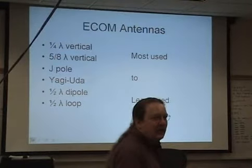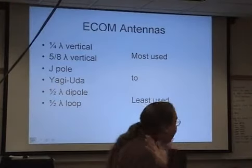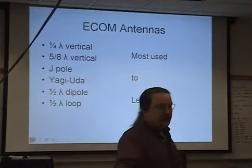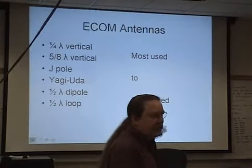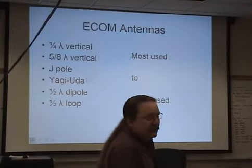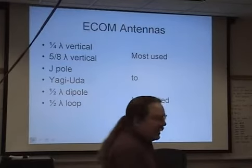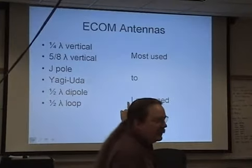If this is really close to, say, a wall, a metal wall especially, or a beam, it will get detuned. It will tend to suck power away from the radiation pattern. If there's anything nearby, say wet trees, within, let's see here, there's the Fresnel and the Fraunhofer region, but they're basically called near field and far field. And I think near field goes out to 10 wavelengths away. Anything beyond 10 wavelengths away from the radiation point is considered far field. So you want to get this at least 10 wavelengths away, and not these condensed wavelengths, but the real 2 meters away from any problem.